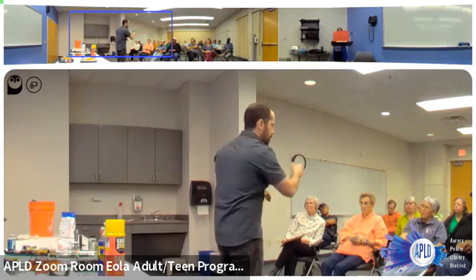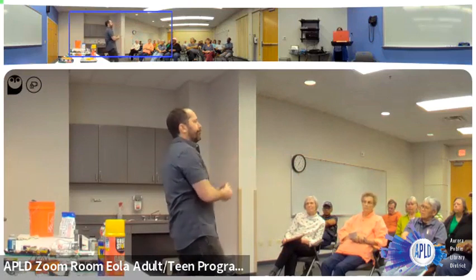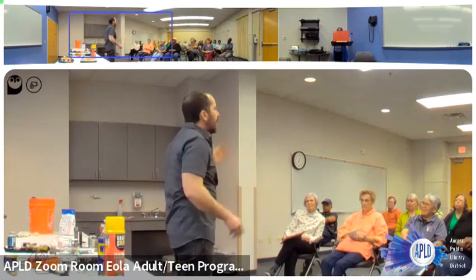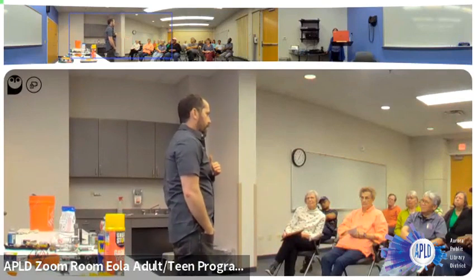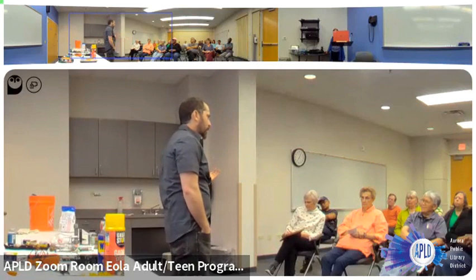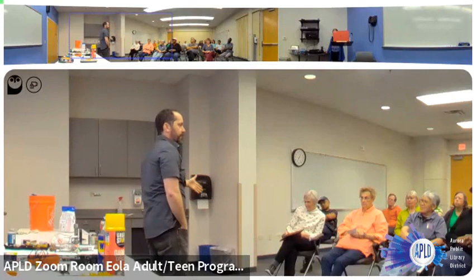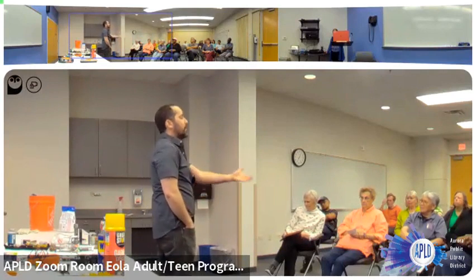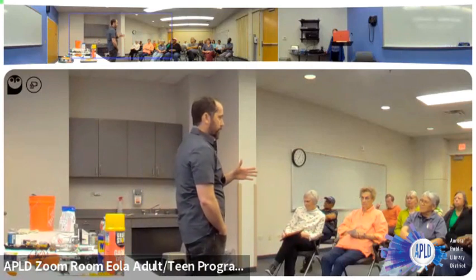What do you recommend to put behind it to hold it in its place? Anything, any piece of wood you got laying around. As long as the reason the hole's there is because, you know, your nephew threw a fit and threw his buddy against the wall, right? If it's where the doorknob is hitting, then you got to reinforce that. If it's something that's going to happen again, now you got to worry about the structure behind it to protect that from happening in the future.